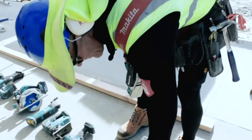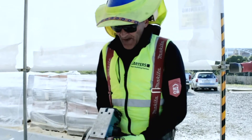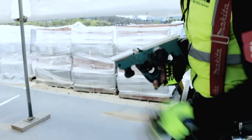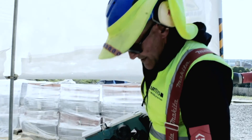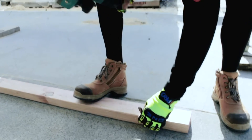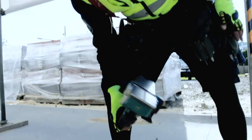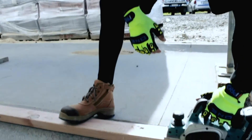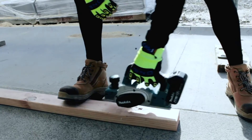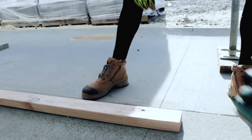All you have to do is grab the battery, it just slips on the back and you're ready to go. The blade on the bottom slides along the top of the timber and it slowly takes away what you want to take away. I'll just put a little pencil mark on the side of the timber — usually you use a ruler to keep it nice and straight. You just lie your planer on the bottom there, and you never go off the side like that; you always come from the end that way. So if this end is on that end, you come from this side that way. Quite simple.